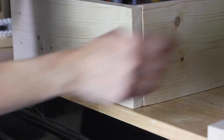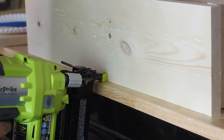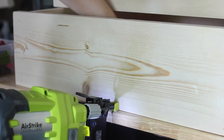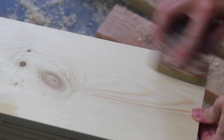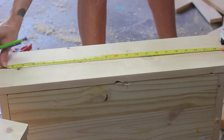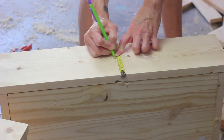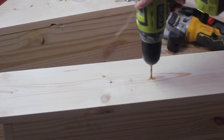When it came time to add the drawer front, I measured in a half an inch from each side and attached it that way so that there was an extra half inch on either side once it was attached. I did this to allow for space for the drawer slides, because my drawer slides were a half an inch wide, so you'll definitely want to take that into account. Before painting or staining, you'll want to use wood filler just to patch over the nail holes. When the wood filler dried, I just sanded it smooth with a sanding sponge. Now it was time to drill holes for my drawer pulls, so I marked the center of each drawer front and measured my handles, marked exactly how wide they needed to be in relation to the center point, and then marked and drilled holes. You can use any type of hardware you choose — I found my drawer pulls at Hobby Lobby.